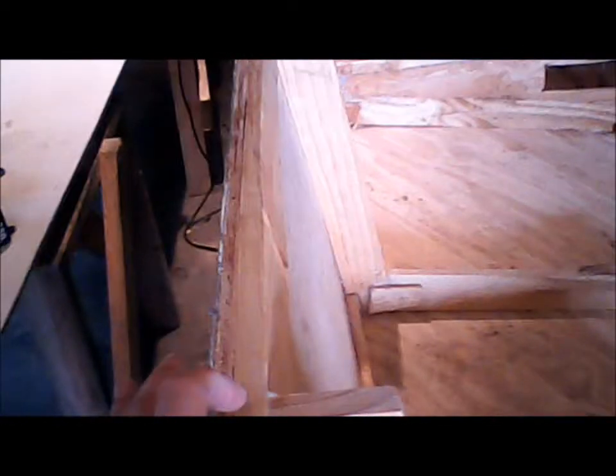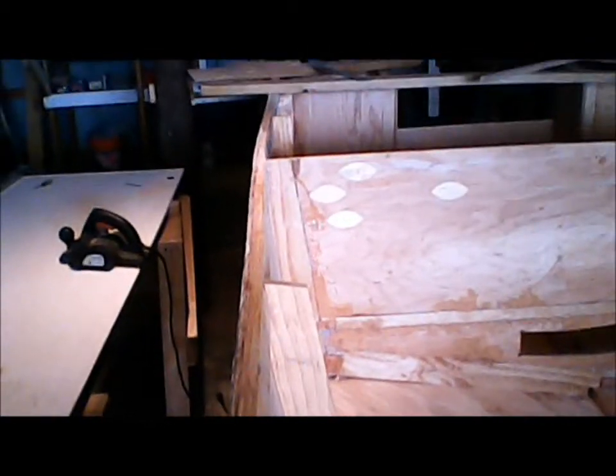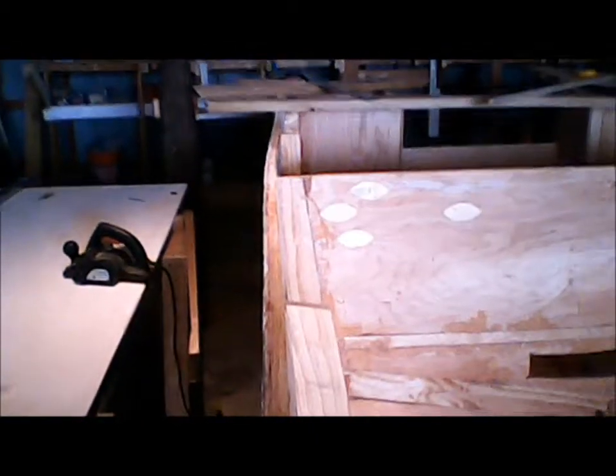What is new is that we are now tying in basically the top of the boat together. So what I'm going to need to do is come over and cut my frames down to where they will accept the 2-inch wide laminated deck beams that are going to run the entire length of the boat. That's kind of on the horizon, right after I get done putting all the epoxy and fillets inside the boat and really sturdying her up.